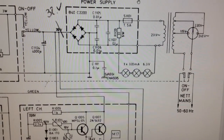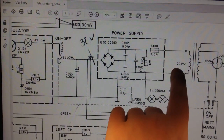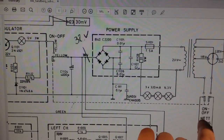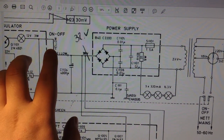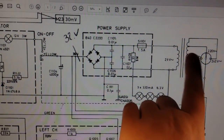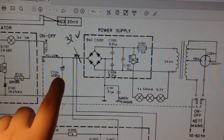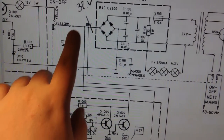Here you can see the three light bulbs — actually I counted two. You have the rectifier: 29 volt AC, get 32 volt DC. They're connected together, so when you push the button you get AC and DC connected at the same time. However, when you switch it off, this part stops charging the capacitor because power is shut off, but the charge will still be in the capacitor because that part is disconnected.